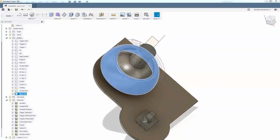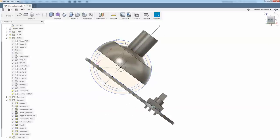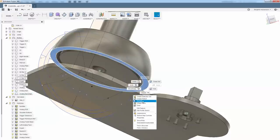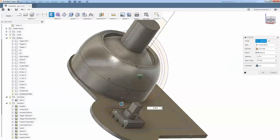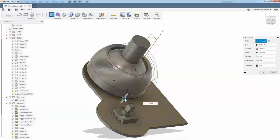Okay, I drew the shell that'll go around the analog nub. I wanted to draw it in space like this just so I could see how it would relate to the directional pad down here. So we'll have some mass here, and then the mass will come up and basically meet at this point. Probably right about there would be fine. And then it'll cover. I could take this and extrude it down to meet where the PCB would be, right? Then I could print just the shell and make sure it fits around the analog stick before I proceed. In fact, I think I'm going to do that.